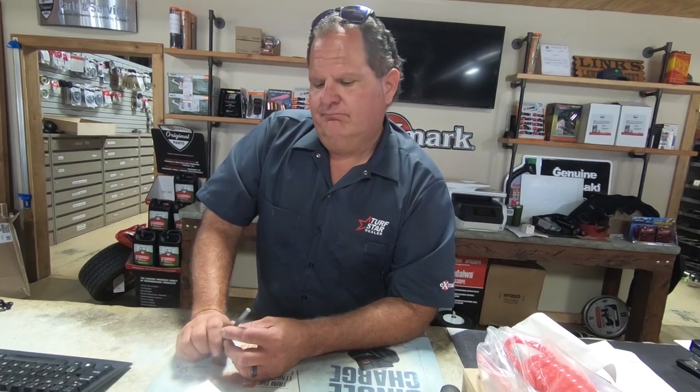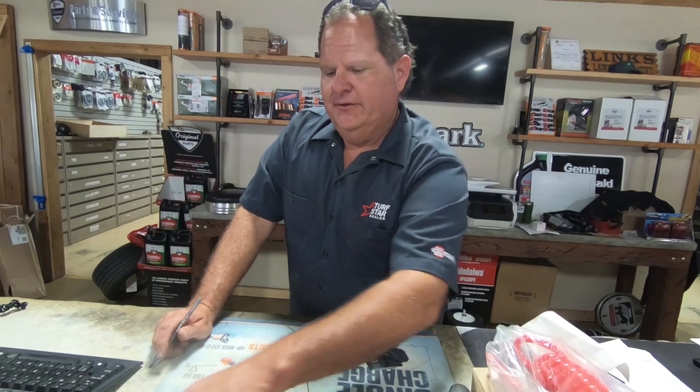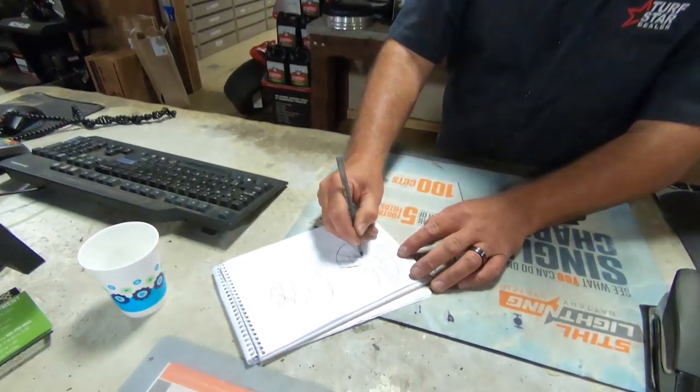I noticed that they look different than the ones that I looked at the GIE. Right. And I think those were Michelin tweels that I looked at down there last year. Well, I'm gonna bring it in. But these honeycomb ones, you can have a failure, but it doesn't affect the rest of the wheel. If you look at the skid steer world, everybody's calling it a honeycomb design. You can have one link break, but you don't lose the structure of the whole wheel, where each spot here is all the way from the tread to the rim.